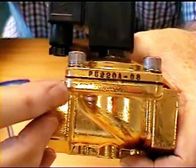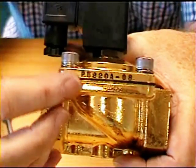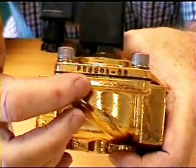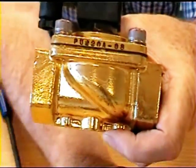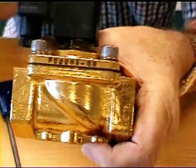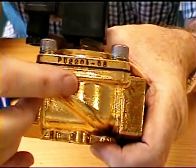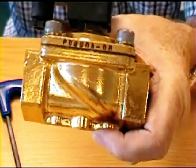In this particular case, because this valve is zero rated — works from zero pressure — it's called a PU220. The 22 meaning it's two ported, two position: open or closed, two ported in and out and two position, open or shut, so PU220, in any voltage you like.